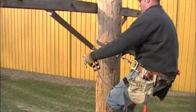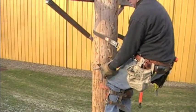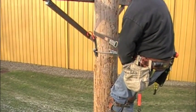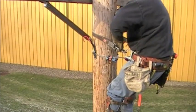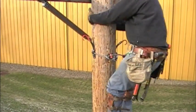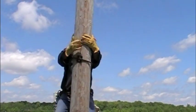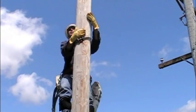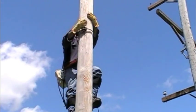On smaller poles, care must be taken to maintain the proper adjustment. Keep the pole lariat as tight as possible. Use the parking tab to keep the pole lariat tight when resting below the waist, always keeping the pole rope as short as possible to reduce the potential free fall. Practice with a fall-restricting device of your choice and integrate it with your normal work procedures until using it becomes second nature.